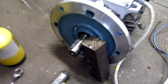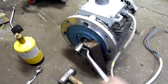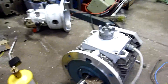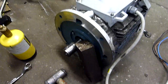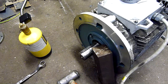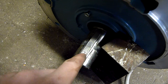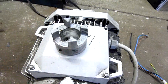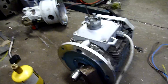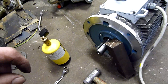There we go. Looks like they used bearing mount to fit the coupling, along with a little bit of heating and leverage, and it just slid straight off. Made in Germany — perfect fit. It does have the original grub screw mark; I can't see any other older marks, so maybe it hasn't been off. It's a German Spidex fitting, so maybe they've never had it apart.